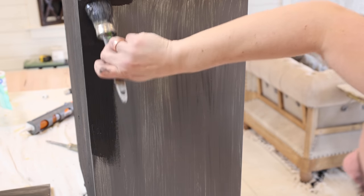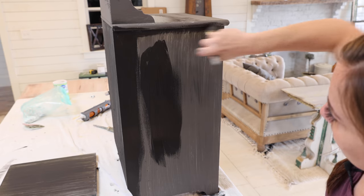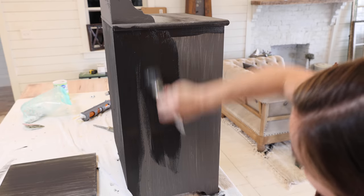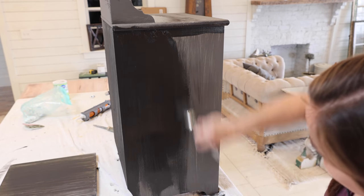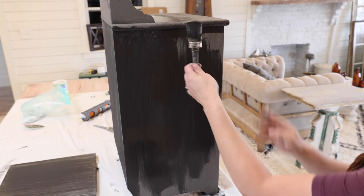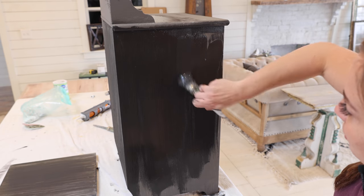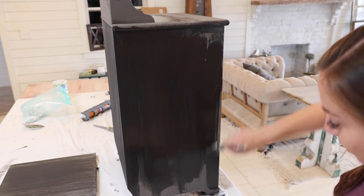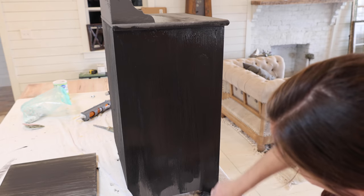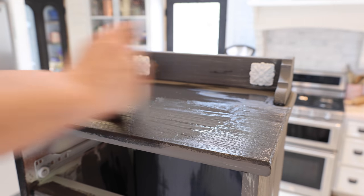You can put on the second coat — easy breezy. Two coats is basically giving me full coverage. The hard part is being patient with the first coat, especially for new painters who want it perfect on the first coat. Make sure your strokes are nice and straight. If you want less brush strokes, hold your brush parallel with your piece and pull it down. You can also use a squirt gun with water, or just sand them smooth. If your second coat doesn't give you perfection, let it dry completely and touch up any little spots with a third coat. If you're going to be distressing, two coats is more than enough — anywhere that's not perfect can just be distressed.